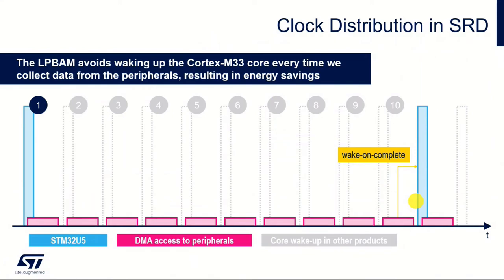This figure is intended to give you an idea of how LP BAM functionality is an improvement over a traditional interrupt wake-up based approach. Using LP BAM, the processor here in blue is running at initial startup — it configures the linked list, configures the LPDMA controller, goes into low power mode, and starts a transfer. We have this pink area here which is the DMA access running in low power stop 2 mode. When you're using LP BAM, you are staying within low power stop 2 mode.